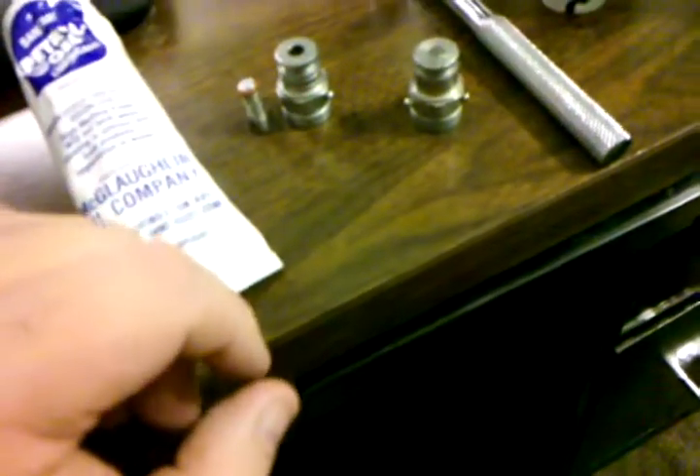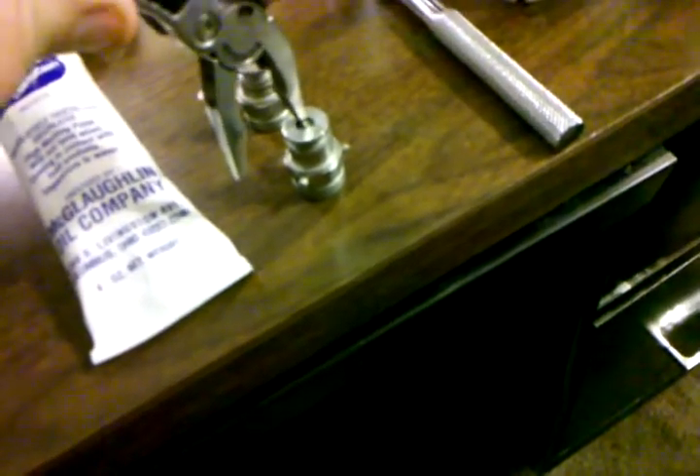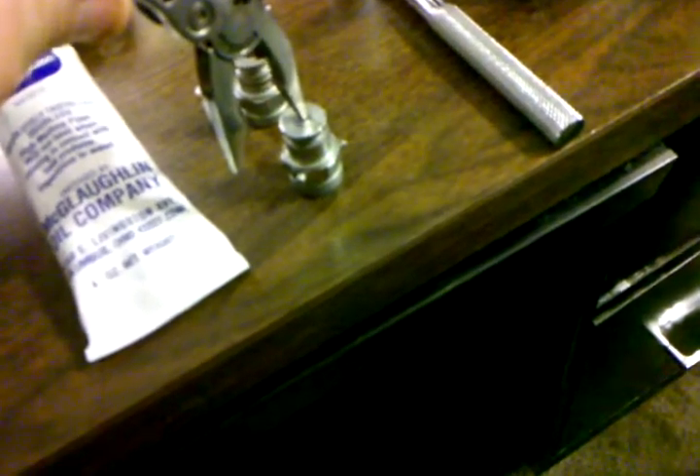To take one of these poppets out, you just take a pair of needle nose pliers and gently press in a couple of times — it'll let loose of the threads on the bottom. Then to put it back in, you just put it back in and work with it until it gets back into place. So those are the posts — liquid and gas — and those are the poppets that go in the posts.